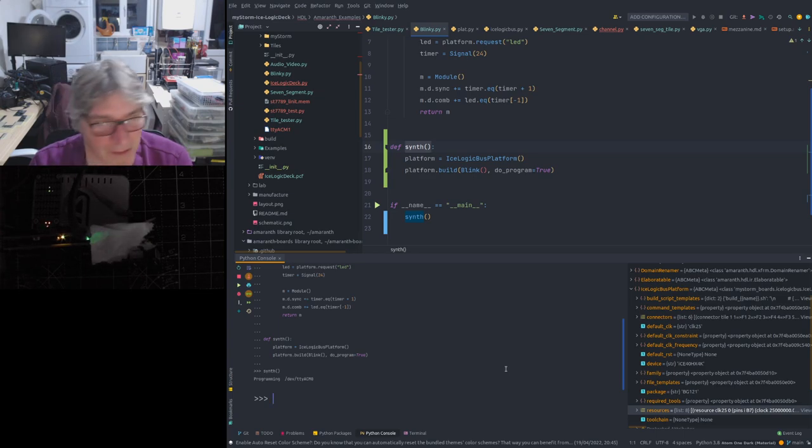As I say, the choices of colours and things don't make this particularly good choice, in my opinion. What I'm thinking of doing actually is, we already know whether it's powered, because both the STM32 mezzanine board, the BlackIce Nxt board, and the FPGA board share the 3V3. So if one works, the other should, assuming the connection's there. So having the green LED work on the STM32 is probably good enough. We don't need to know that there's power on the FPGA board.